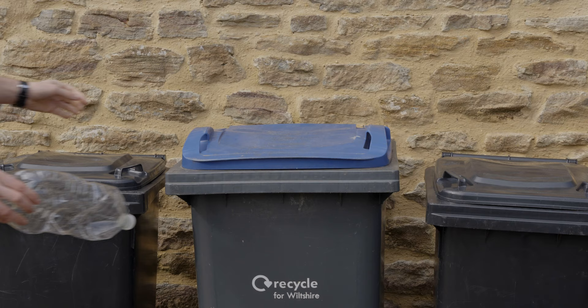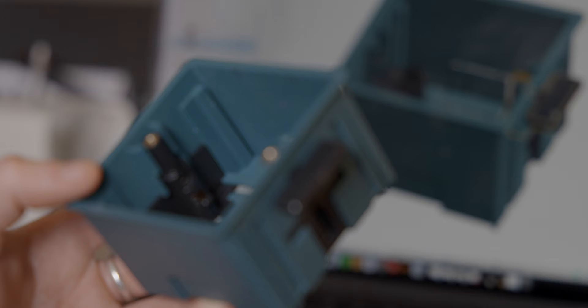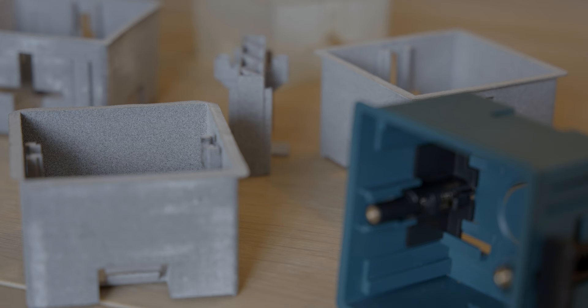This material is much more challenging to use than brand new plastic — it's a bit more expensive and more difficult to work with. The plastic that goes in your waste bin goes on a really long journey and you don't quite know where it goes. To get waste plastic back into the manufacturing supply chain it has to be sorted and goes through quite a few steps and processes. We had to investigate all of those processes to make sure that the plastic we're using is actually 100% recycled. When you have recycled plastic you lose a lot of the mechanical properties that virgin plastic has, so it's a lot of experimentation and trial and error to make sure you get a really stable product rather than something that's flexible or deformed shortly after.